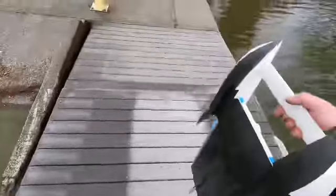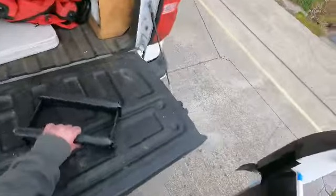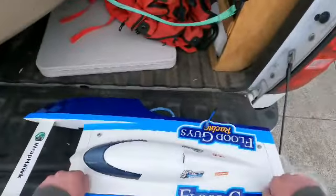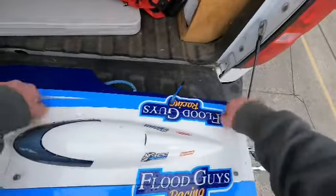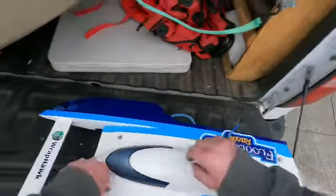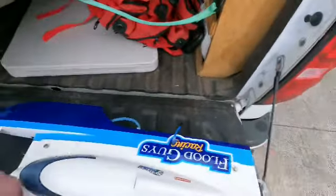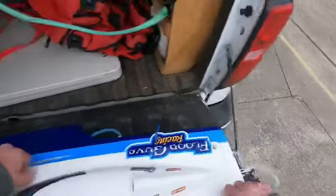Water pickup, as you can see right there. Good water spray, both ends. We'll see what the temperature is and what the readout is. We'll check temps first. I do have a couple other propellers coming in the mail, so I'm gonna be trying those out a little bit later. That's where I'm experimenting with a different water pickup. The propellers are gonna carry a bigger diameter and a little bit more pitch, trying to pick up a little more speed.